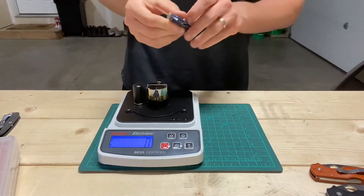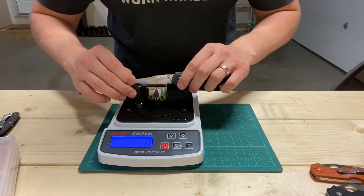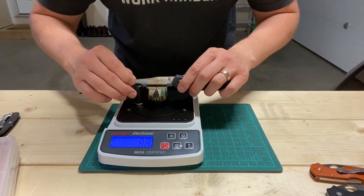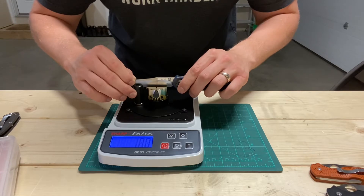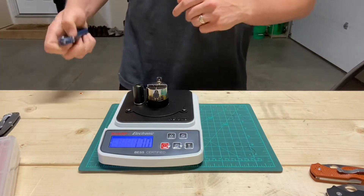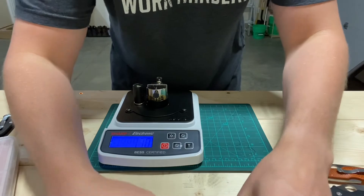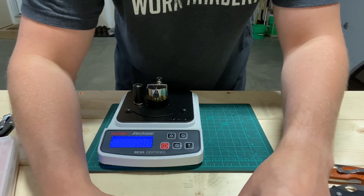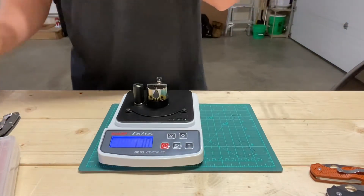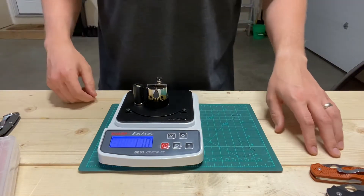This is 20CV at 59 Rockwell — my very educated guess. This one's doing worse: 170. I did not do a very good job of writing these down. 20CV: 170. It had done a 250 prior, so I should probably do that one a third time. I'll set it aside and come back to it.